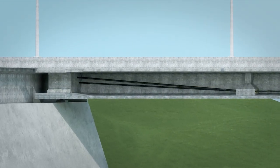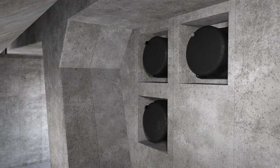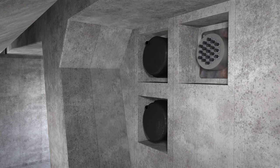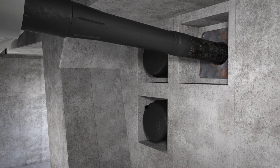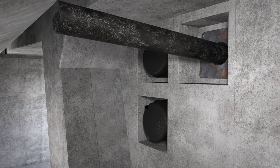Both anchorages need to be removed, so let's move on to the left abutment of the bridge. Looking at the abutment diaphragm wall, we see the cut tendon extending from the wall face. Taking a look at the other side of the diaphragm wall, we see the anchorage that needs to be replaced. Similar to the central pier anchor, the grout cap and its encasing PT grout are removed, freeing the replaceable wedge plate from the cast-in bearing plate and allowing for removal of the anchorage. Note that abutments with replaceable PT tendons need to be detailed with sufficient space behind the diaphragm wall to allow for tendon replacement. Here we have enough space behind the diaphragm wall to remove and replace the wedge plate, the inner trumpet, and part of the post-tension tendon. Depending on the space behind the diaphragm wall, the tendon might need to be cut into sections to allow for removal.